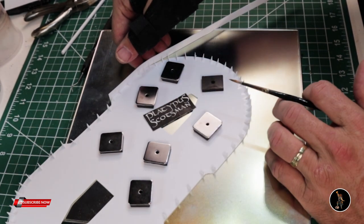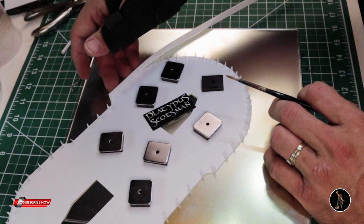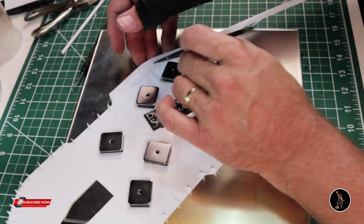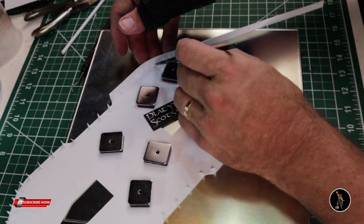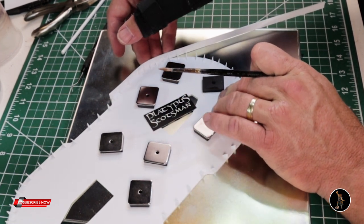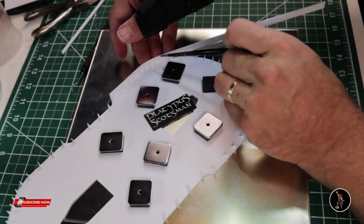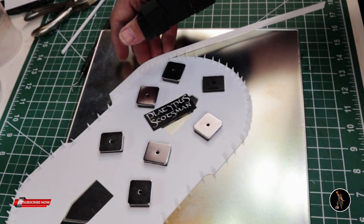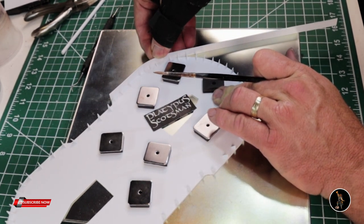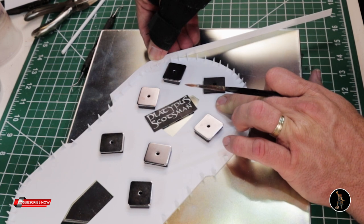I've done stuff like this before where I put ribs up — and this is just how you do a rounded edge. Put a bunch of ribs up that are 45 on one side and 90 on the other. I've already glued this, and what I'm going to do is just slowly start going around and pressing it down, then glue it, making sure it's on the ribs. Don't go too fast. You want to make sure this first part is really secure before you start. Make sure there are no seams or gaps. This is another good use for the magnet jig — just to hold this down and make sure everything's all snug.